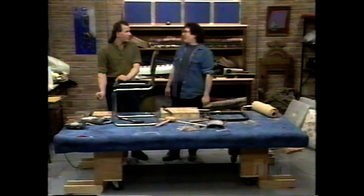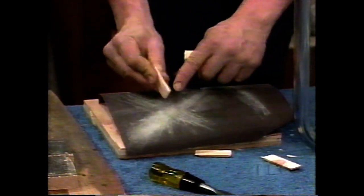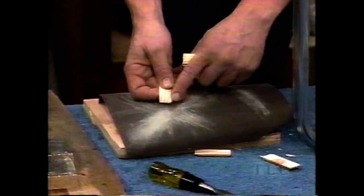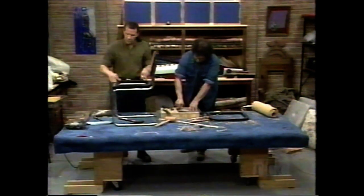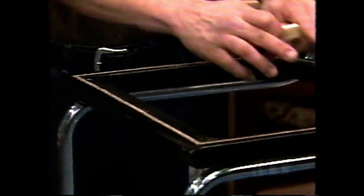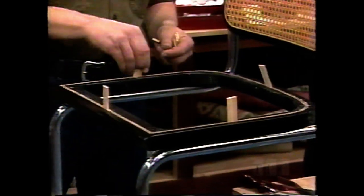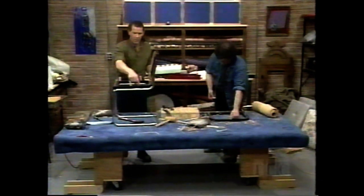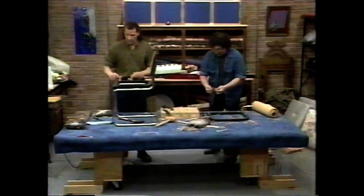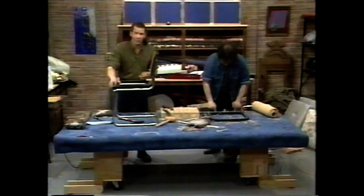The wedge is smaller than the channel so it fits in. You'll probably need about twelve wedges. Before you do any of that, the channel has got to be really clean and you've got to put some glue in there — otherwise it's not going to stick. You can use regular white glue or yellow carpenter's glue. Swish the glue all around in there — make sure it's on the bottom and the sides of the channel.